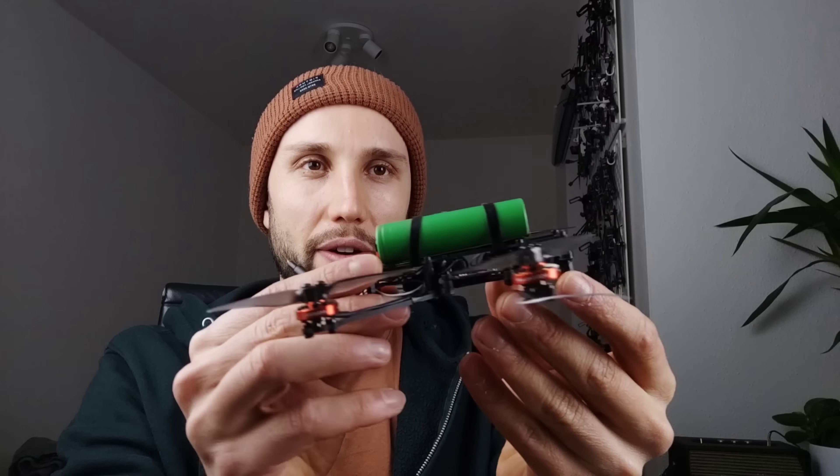This is a three-inch platform designed to be powered by a single 18650 cell, which you see on top here — basically 3000 mAh 1S. I say half-jokingly calling this Nano Long Range because Long Range is a bit of an overstatement. The current iteration does fly for something like 15 minutes, and it has a 450 milliwatt VTX and Crossfire so you can get decent range, but it's more mid-range. You'll get maybe two or three kilometers quite easily, but that's not really long range. For marketing purposes, Nano Long Range makes sense — I have the micro long range, the mini long range, so Nano Long Range fits.